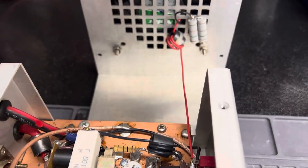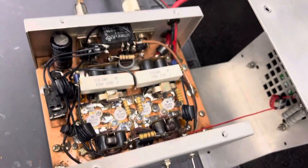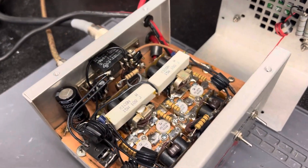I know you said something about this fan being too loud, but you're gonna have to live with that because I don't want to put a slow fan on it. The reason is you've got four 2879s in there in a sleeper box — what I call them — and you ain't going to get enough air on the heat sink in there as it is; it's small.